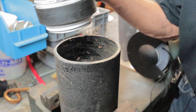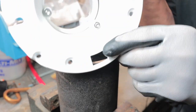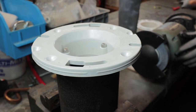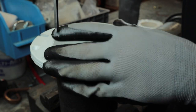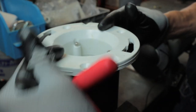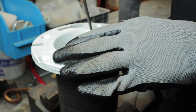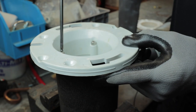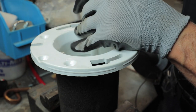Now here's the second product in the cast iron. You just drop it in and come in with your 3/16-inch allen key. Alternately bear down on those screws — make sure the slots are where you need them. If using the two bolt slots, use those; otherwise position so bolts are perpendicular. Measure off the back wall to make sure everything is square. As I bear these down, it pulls up the plastic at the bottom of the flange, expanding the gasket against the wall of the pipe.